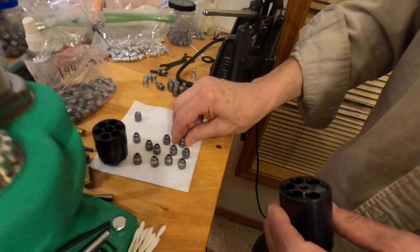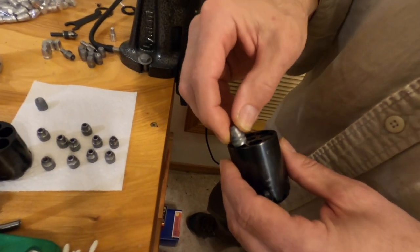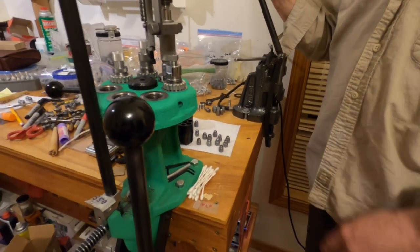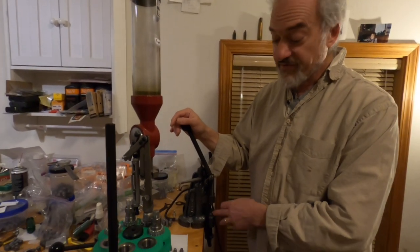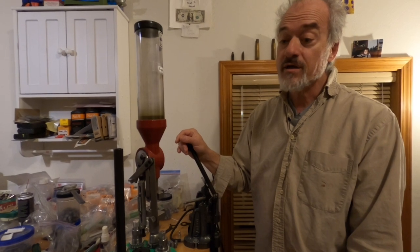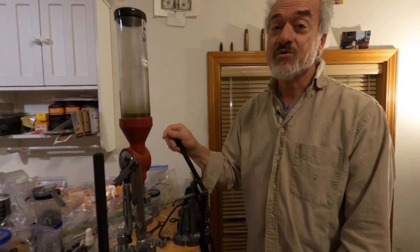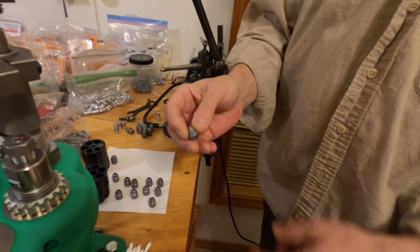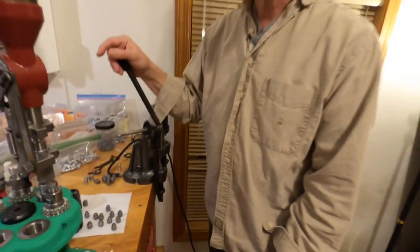I mainly wanted to show this process which allows you to use a standard modern .45 bullet in a percussion revolver by squeezing a heel onto it — and as you can see it works very well and is not very time consuming, just an extra step. If you don't want to cast bullets at all, you can buy swaged lead bullets for .45 ACP and run them through the same process, and they will load in your percussion revolver. A 230-grain round nose is a pretty good projectile for a percussion revolver. It may not have a lube groove, but you can top-lube if you want, or put lube cookies underneath — though that takes up a lot of your powder capacity. I like to use a lube-groove bullet, and if I'm shooting a lot I'll put a lube cookie underneath it.